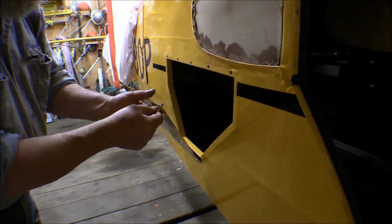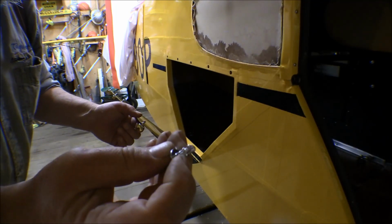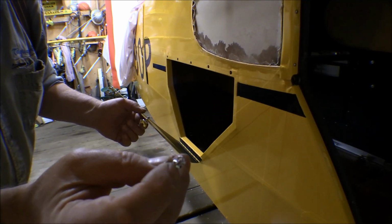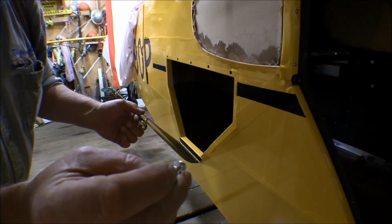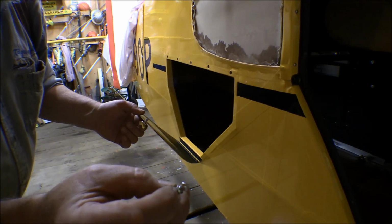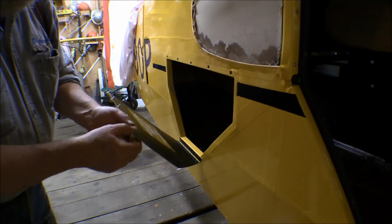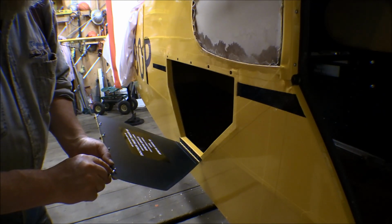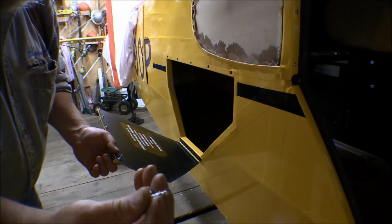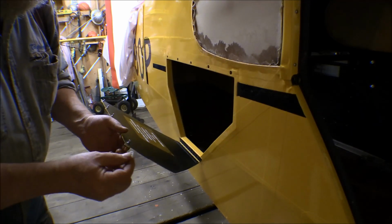Now the mount hole for these Southco fasteners is larger than the diameter of the shank of the fastener, and it has to be larger so that you can get this cam in there. And there's a little ring molded onto the end, or forged onto it, however they make that, and that's also larger than the size of the shank. So those things would just fall out of the hole, but they have a little spring-loaded washer that fits over that, and you push that on, and once it goes on, it snaps in behind this ring, and that's what holds it in.